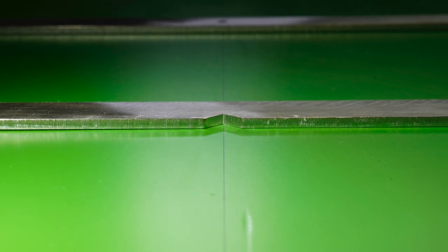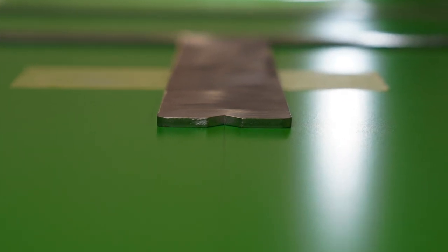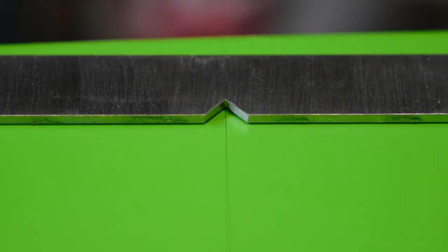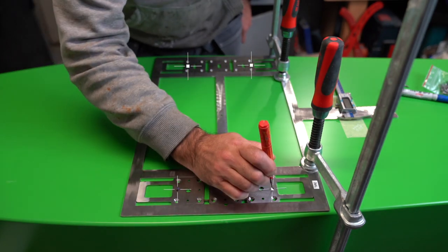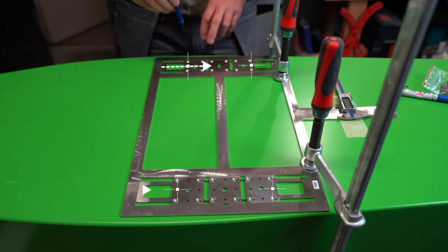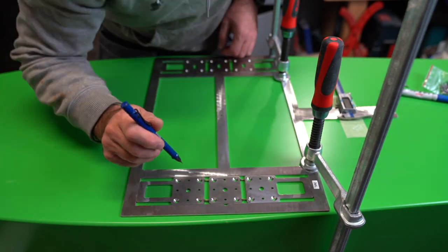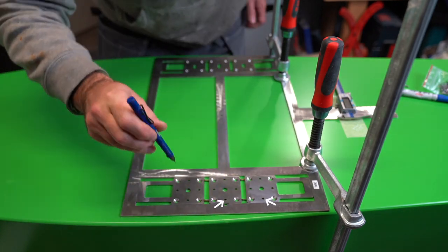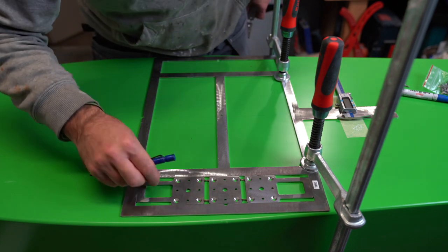Just like you see on the photos. If one of the lines is off, make sure that your main reference line is the hole's centerline and the other line is as close as possible to the notches. Clamp the jig, put tripads in, and start marking references. Two holes on each tripod to draw centerlines. Transferring big holes is not necessary but may help. Then three important marks on each side. And we are ready to remove the steel.